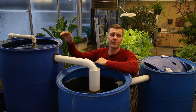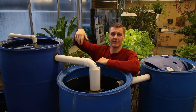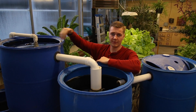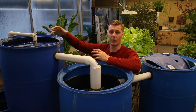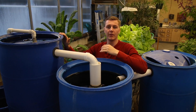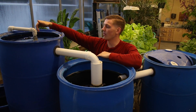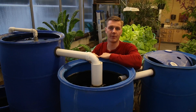The first filter we have in our system is a spiral filter. The water is being piped around the side of the filter, making a spiral, and using centrifugal force to pull the solids out of the wastewater that we can collect in this barrel. The water that's left over will be piped down the middle and into our next barrel.